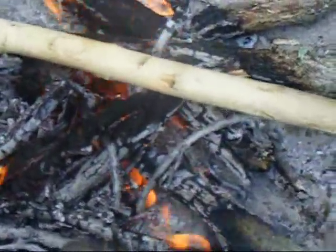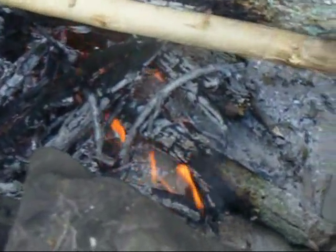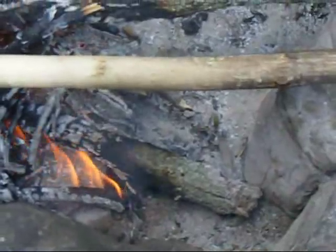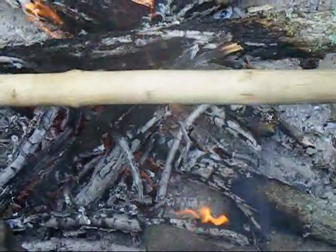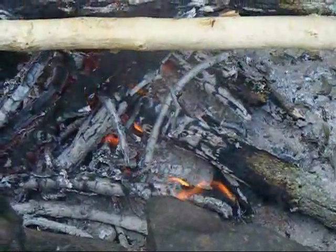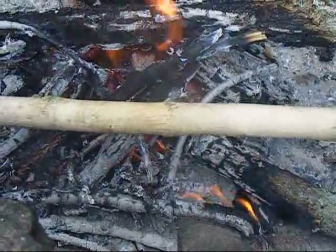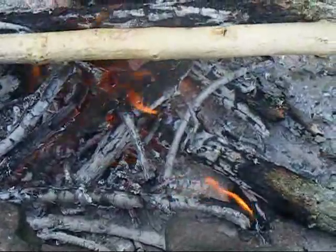What I'm doing now is I've moved down on the stick a little bit. That took this notch out real pretty good - it was a big bend right there and we got that out pretty well. But we still have a slight bow in here, so I'm getting the stick a little more heated up a little further down. We're going to have to do this three or four times until we get the stick pretty straight, so let me work on this for a little while.